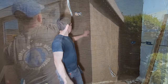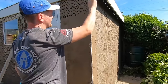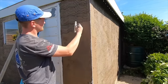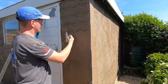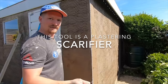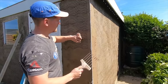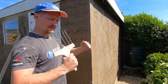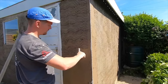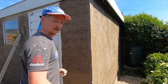I'll show you how to do a scratch coat. Don't go in too deep when you're scratching — just go on the surface. You want to apply some waves; that way the top coat is going to stick firmly onto the scratch. Because you've got the waves, if it contracts it will buckle into each shape, meaning you've got a stronger grip.